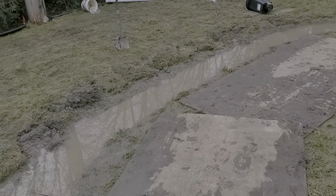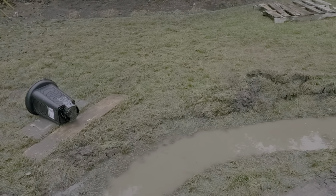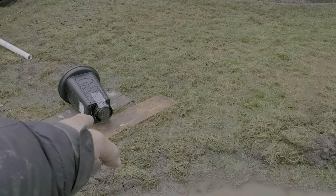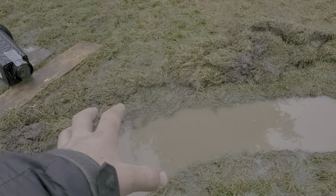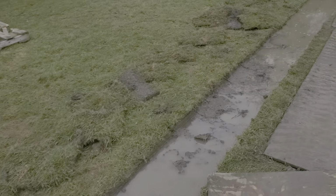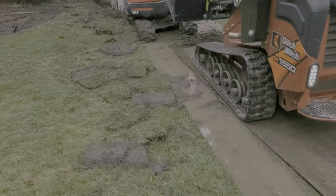That's how you collect water. That's how you design your system. Just look for the lowest points. If you want to build a yard drain inside your French drain and just make the most of that trench, I recommend it. All the bulk water here, I definitely want a yard drain with my French drain.